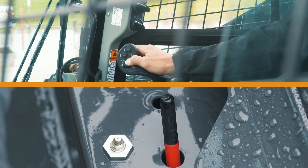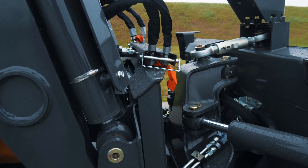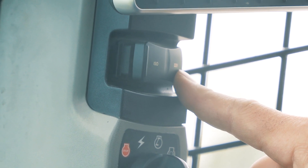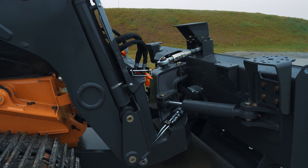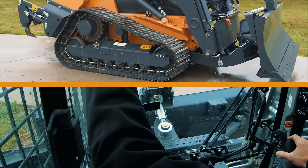Once you're in, you can throw your pins and lock your coupler on. After that, you curl, retract the tilt cylinders on the machine, and then switch over to dozer mode. The pins that lock the C-frame are only controlled when you're in dozer mode, so once you get coupled, you want to retract your C-frame pins and start lifting up the C-frame.